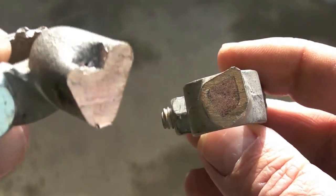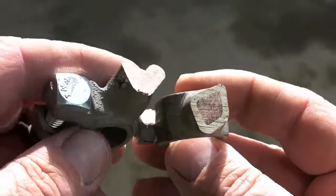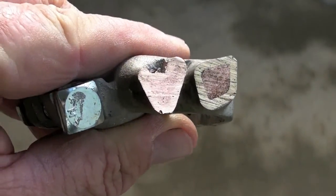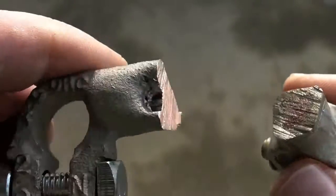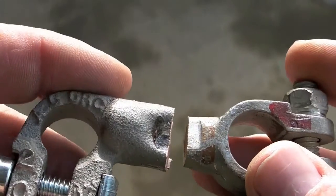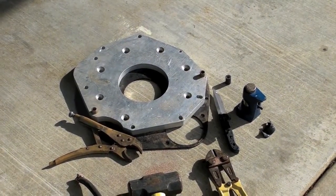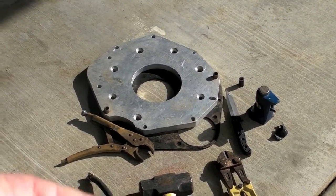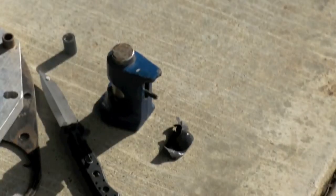The hammer crimp pretty much makes almost a solid piece of wire once it's hammered tight. I'm going to get some high res pictures to add to this. The visual results speak for themselves. It does take a little bit of energy but it gives you a solid foundation. I've got a big aluminum piece down there from an old adapter plate. A flat steel plate underneath helps protect the driveway because you're hammering pretty hard — don't do it directly on concrete, you'll bust your concrete. That little hammer crimper is a pretty slick little setup.